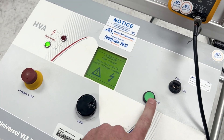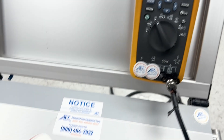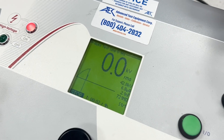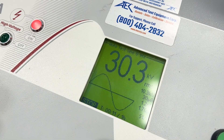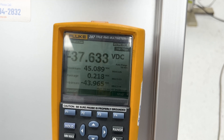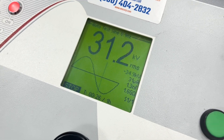At this point we've got to hit the high voltage button, and here's our verification right here. So it starts drawing out the sine wave and we see what our actual value is right now. After each cycle, we get a new RMS value up top. To verify, we can see our VLF voltage slowly increasing and decreasing up here. Basically the test would go through and do this for an hour and then you'd come back and see what it looks like.